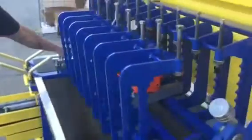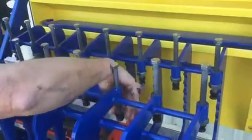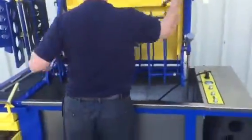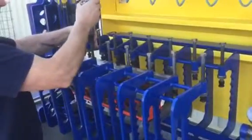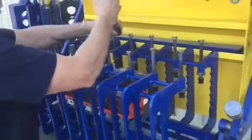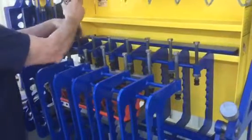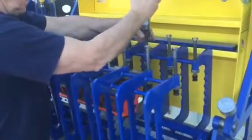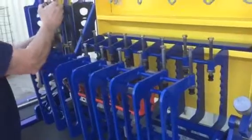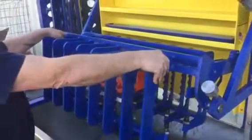What I like to do is put these supports on the top so it just spreads out my load. You don't have to, but that's just what I prefer to do. So we're going to set these up here. Again, make sure you can get to your water openings and I'll show you why. We're going to take our air gun and simply start from the center and work our way out. Okay, so we've got the head locked in there. Now this pressure tester has a 360-degree rotating cradle.